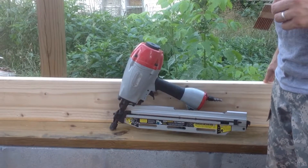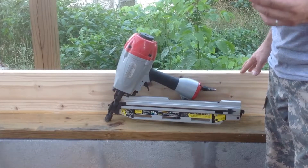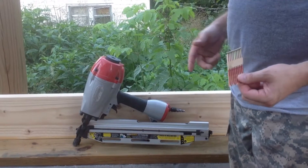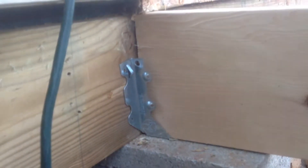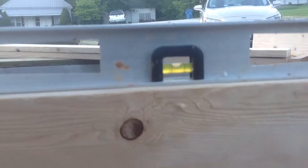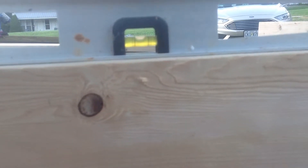We are ready to put in the floor joists. We've got them cut. On this side, since we can get to it, we're going to use framing nails with the pneumatic nailer. I forgot to buy more nails, so we'll get started with what we have, and on the joist hangers on the other side we're going to use deck screws. I've got one joist cut and as you can see it's level. That's important. If it's not exactly level and has just a hair of a downhill slope, that's better than going the other way — a little downhill away from the center of your house is not bad.